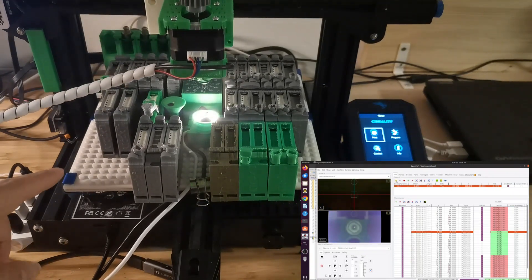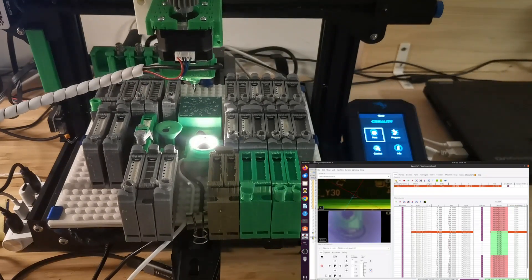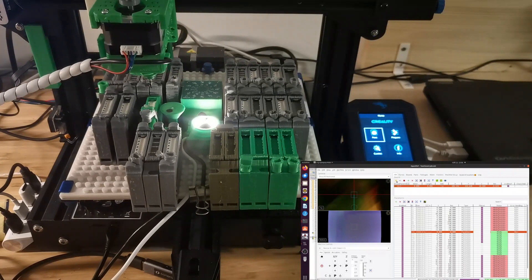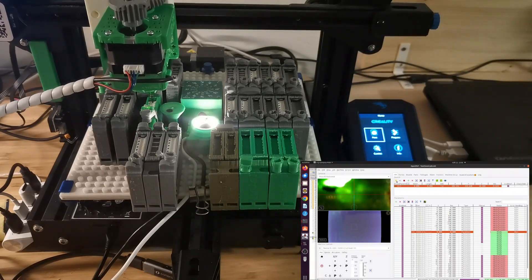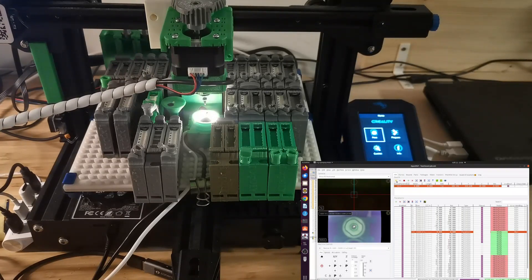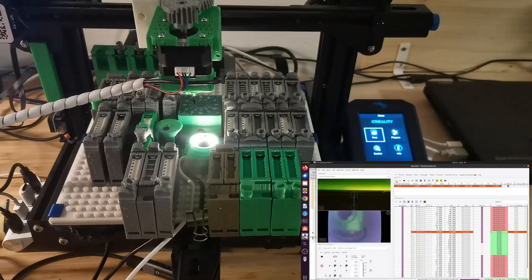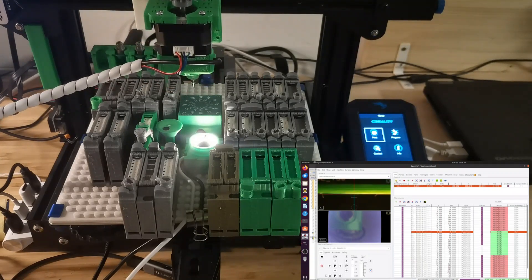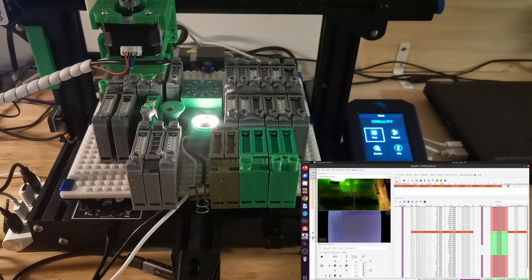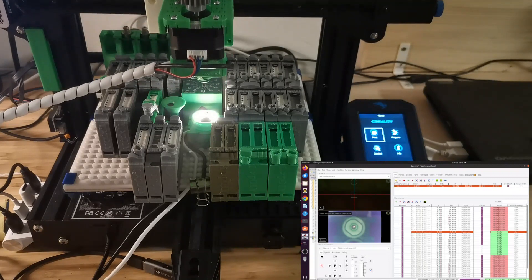Because this is battery powered, power consumption is really important. Currently I have already run it for two days, but I'm only using the light sleep mode — it's not heavily optimized yet. My goal is that for one charge the usage should be at least one week, so you don't have to keep charging the battery and loading and unloading.